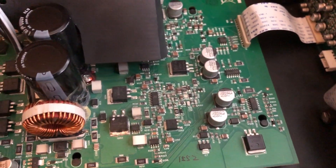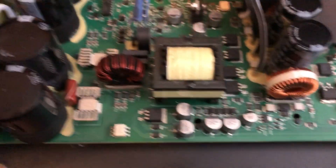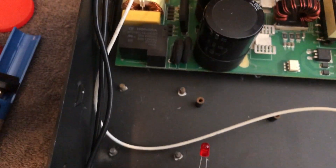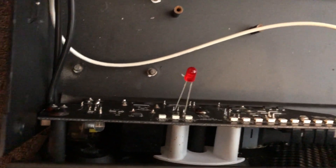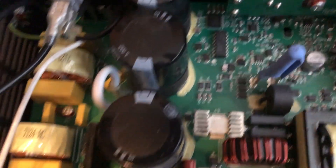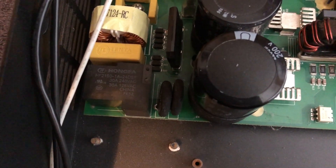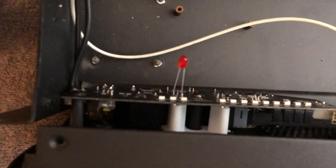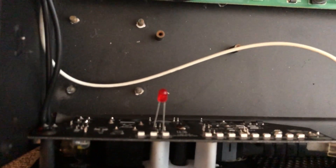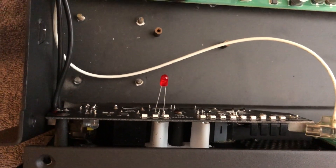Get to the output section. There's a fan behind there. Ribbon cables that go to the display — it's clean. So main AC comes in. There are three wires that go to the front panel here, which controls the power switch, and there's a funky LED sticking off of there. That board and those three wires are what has the power come in and off the mains, with the exception of the circuit breaker off the top. So we've got a leg of neutral, a supply line, and a return line. That return line goes back to the board and goes through these choke coils and then the main power board relay that kicks on the rest of the amp. The main switch and all that — there's no other fancy wires coming over to this board. It's just the main supply, a return line, and neutral.